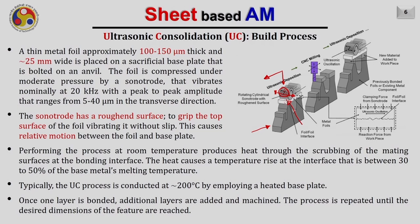The process is performed at room temperature and it produces heat through the scrubbing of the mating surface at the bonding interface. The heat causes a temperature rise at the interface that is between 30 to 50% of the base metal's melting point. So look at this carefully. This is the interface,